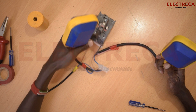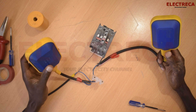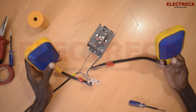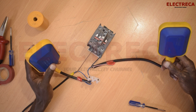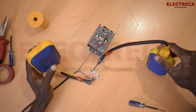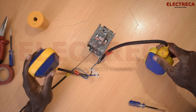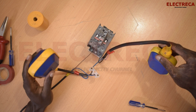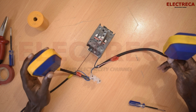Now let's power it up. I'm holding the two float switches — the one in my left hand is the lower tank float switch and the one in my right hand is the higher tank float switch. With both in their normal positions the contactor is open. I flip the higher tank float switch and now the contactor closes — meaning the pump is in running position. As long as there is water in the lower tank, the left-hand float switch stays closed, and the right-hand one stays open while the tank still needs filling.